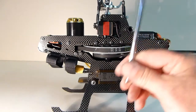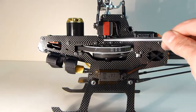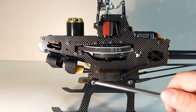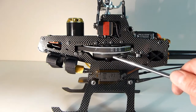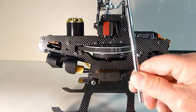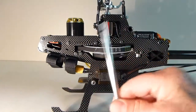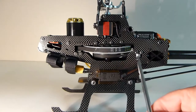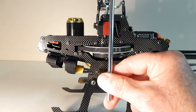On the original model, the motor being installed in the rear was putting a lot of load on the main shaft, especially on the lower and upper bearings, because you had load from the belt drive for the main gear and from the belt on the tail rotor drive pulling to the rear. Now with the motor in the front, it balances out more — load pulls forward and backward — which makes the main bearings last a lot longer.